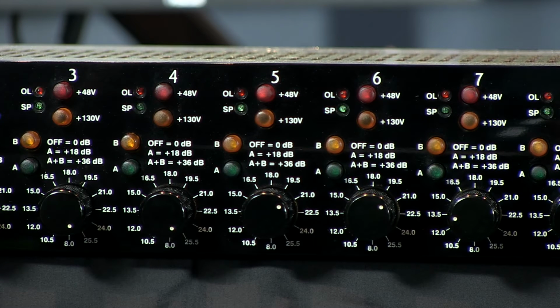Its laser-trimmed FET-based output stage has 32 dB of headroom, which drives a 1,000-foot cable run with ease. All the connections are gold-plated, which means it will not corrode over time and cause any kind of faulty connection. The total harmonic distortion is negligible, coming in at 0.0005%. And the frequency range goes from 3 Hz to 300 kHz, which is almost unheard of in a preamplifier.